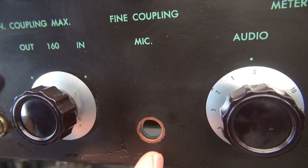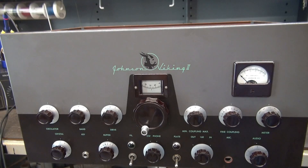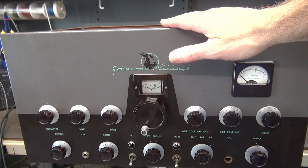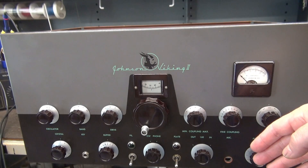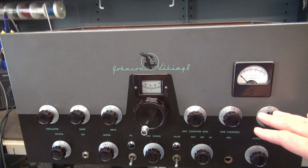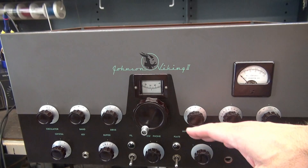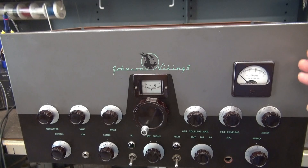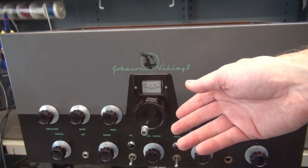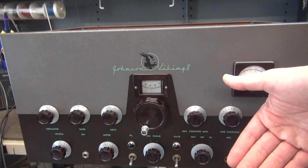To drill it out, you've got to pull the front panel. You're probably thinking that's a lot of work just to put in a mic jack. But there is a hidden bonus here. You have to remove all the knobs, and there are some nuts behind those knobs you have to take off. There are about five screws down the left and the right side on the inside of the chassis. You unscrew those and then this panel will come forward and drop right off.